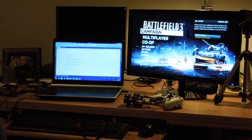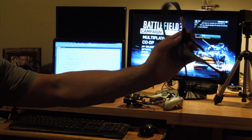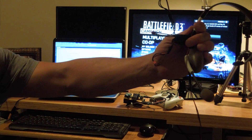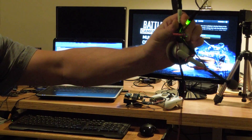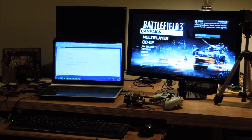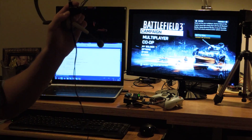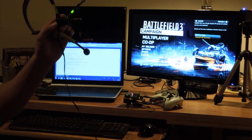A couple of infrared LEDs make up the head tracking headset. You'll see there are three infrared LEDs on the end here. When I turn the power on you can see a muted purple color — that is the infrared light. Humans can't really see it, but cameras can. When I hold that up in front of this, which is the camera and microcontroller setup, you can see it lights the blue light to let me know that it can see three infrared dots.